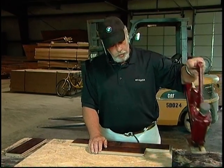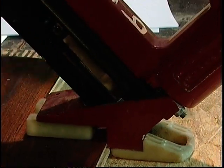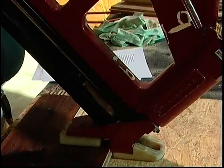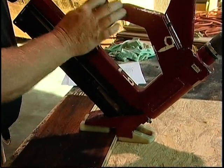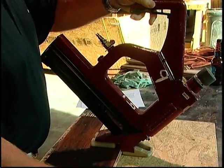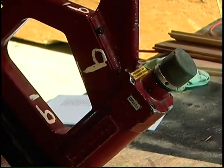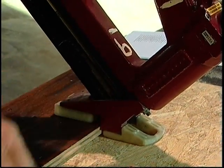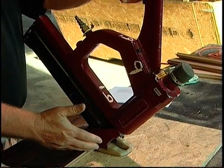This is a pneumatic nailer. All this amounts to about a 40-degree angle — it goes on here, it's obvious. It goes into the tongue, clips on the side. Hook your air hose up here, take the hammer, pop it — it'll drive the nail. Some you want to hit harder obviously because if a board has taken on some moisture, it may have just a little turn in it and you'll have to hit it harder.